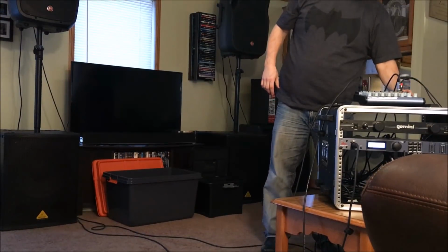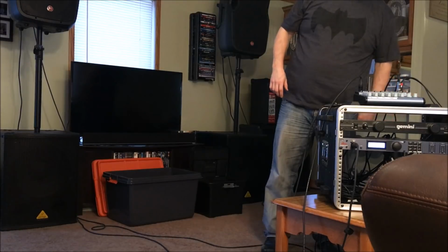You'll want to have everything in place: all of your mics in place, all of the levels turned down, and then you'll want to turn on your mixer. So I turn the drive rack on first, and then the mixer second, and make sure the mixer's main is all the way down to 0. It's very important, because the last thing you're going to power up is your powered speakers, and you don't want any signal going through that will damage them, or be so loud, with a lot of feedback, that it busts everybody's eardrums. So the mixer comes on next, and then the powered speakers. Mixer's main is down, I'm positive. Mixer is on.